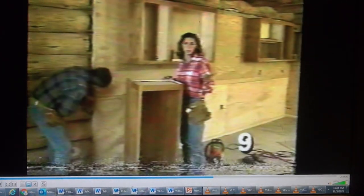We've set in a couple more cabinets to get us to the end of the row, and these all went in pretty much the same as the first one. However, we did leave a four-foot gap right here to accommodate the range and vent hood we're installing later. I cut in a vertical notch here to the logs along the plywood, and that should help hide our nailer later on.